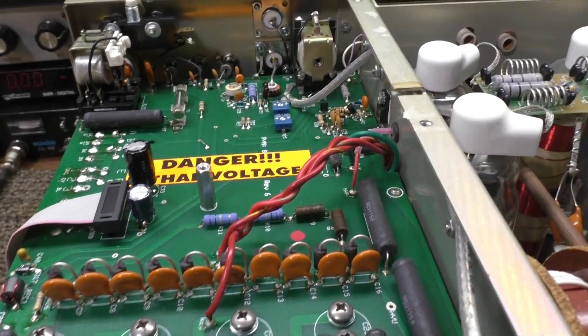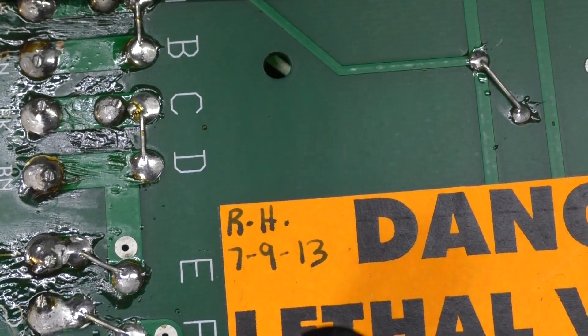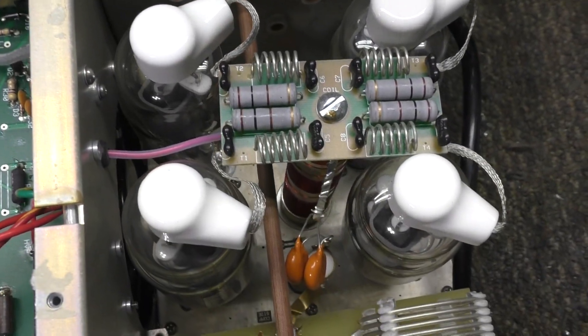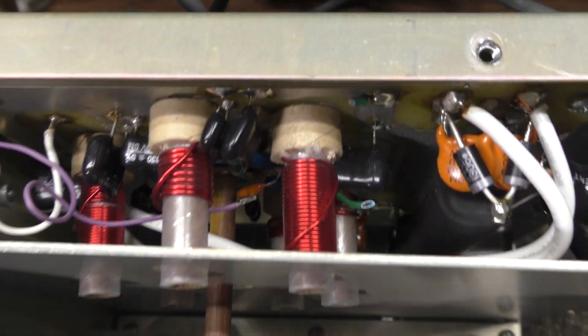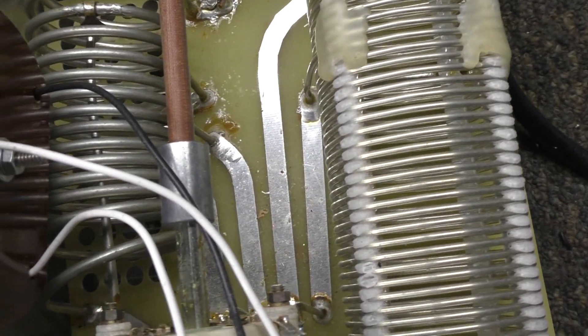This is a nice 572B. It's got a date on it — looks like 7/9/13, so it's a fairly modern amplifier considering it uses four 572B tubes. It's pretty well made, uses a pi-tune input circuit that's variable. You can go to the back and through the backplate to tune the coils for the input, and I think they said it has a pi on the output tuning as well.